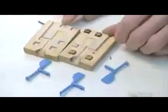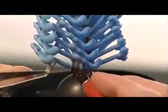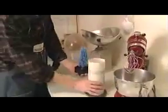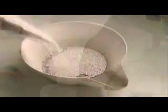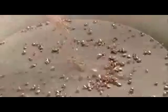Now they build what's called a tree. Using tweezers and a heated pen, they fuse the wax duplicates to a wax trunk that's 17 to 25 centimeters tall, depending on the type of flute. Then they place the tree in a perforated steel flask covered in masking tape. They pour in a liter of plaster, which hardens around the tree. Then they remove the tape and heat the flask. The wax melts through the holes, leaving plaster cavities in the shape of the key parts.